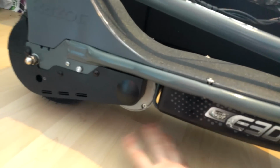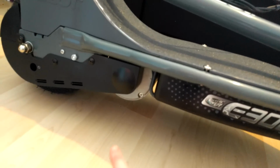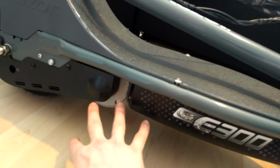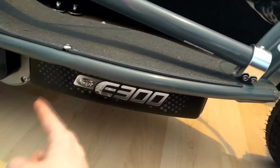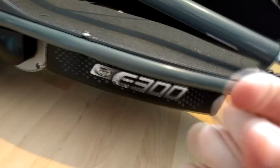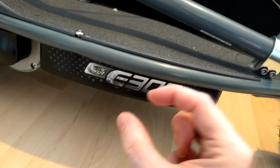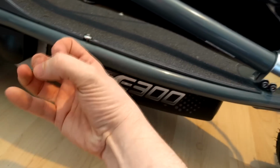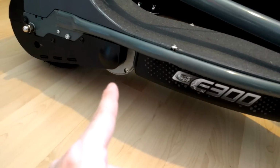little bit quicker. The stock motor that comes with it, I've already burnt that out, completely fried that motor. So it does work, but it will only work for like 5 minutes and it will heat up and just stop working. The reason I destroyed that motor is the onboard electric controller, which is the brain that goes, you have this much power now, let's go. I've done a shunt mod. A shunt mod is where you've got this thin bit of wire that controls how much current goes to the motor. I gave it a big chunk of wire so it allowed more current into the motor. It killed the DC motors.